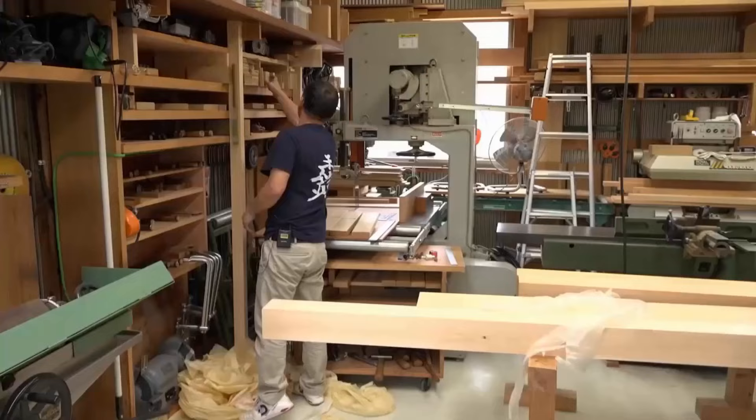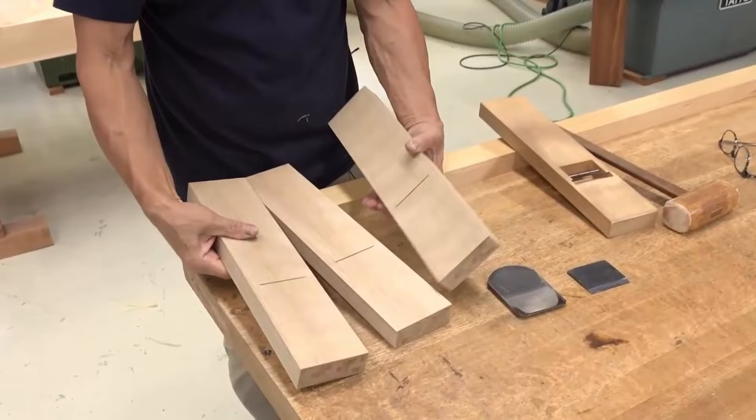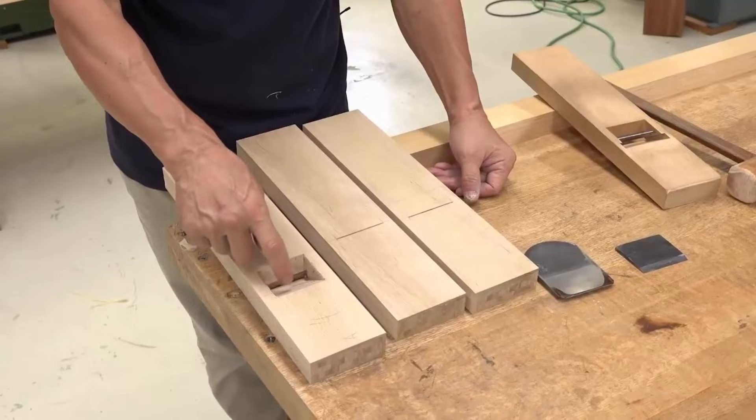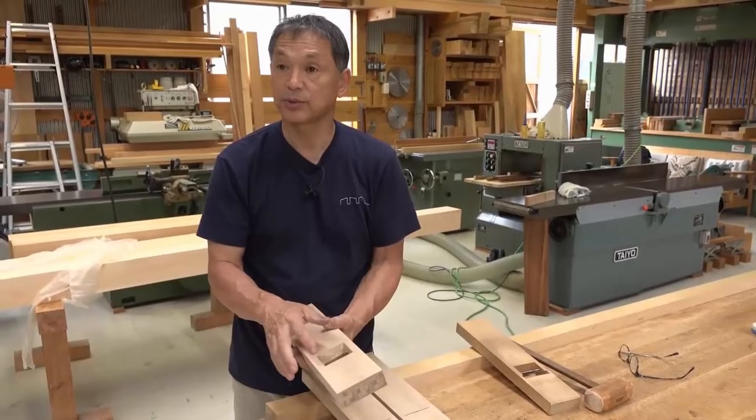I've made hundreds of plane bodies in the past. I'm used to making them, so it's part of my routine to work on them in the morning and evening when I have spare time. I've made the bodies for all of the planes here — preparing them myself makes them fit for purpose. Here are some I've been working on recently. They're all roughly cut and carved, then left to rest. When wood is cut, exposing the end grain, it starts drying out from there. After producing the laminated wood, I finish the rough cutting as soon as possible and let it sit to dry for several months.